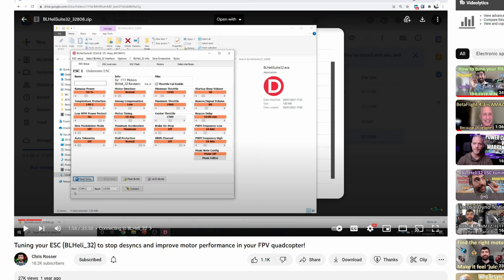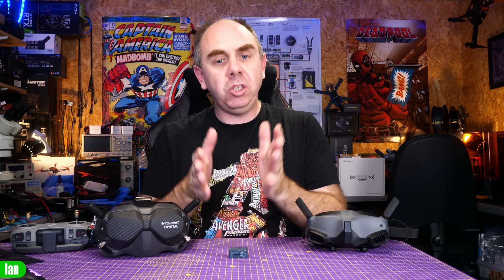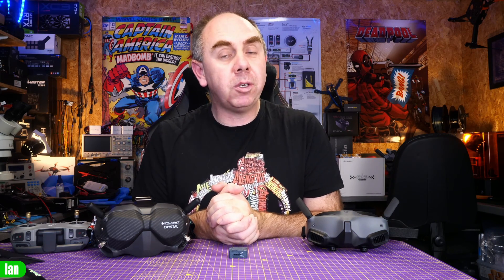Chris Rosser has a great video covering PWM frequency on ESCs and will likely have more to say on this in his review. Looking at the camera specs, it is pretty much the same as what we have on the Avata — a 20x20x20 mm camera with a 1/1.7-inch sensor and 48-megapixel equivalent resolution. It has built-in gyro data and supports additional colour profiles like D-Cinelike. The camera is fitted to the DJI air unit but can be removed, leaving the door open to potentially seeing cameras from third parties in the future.